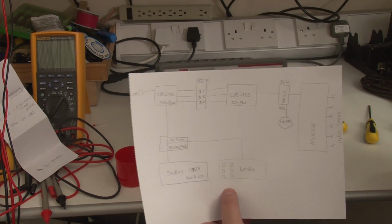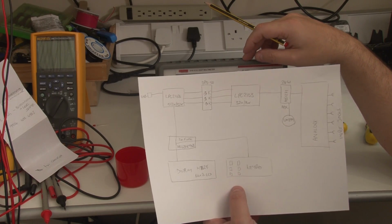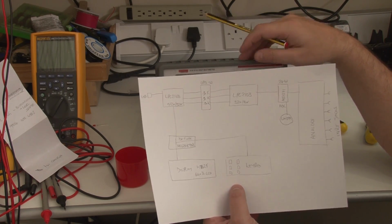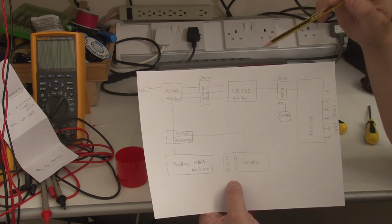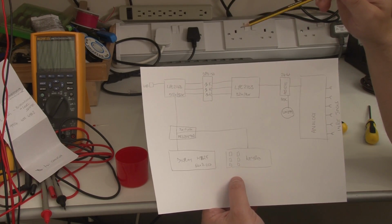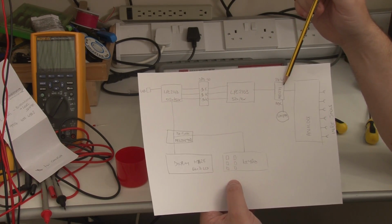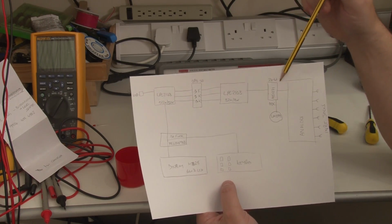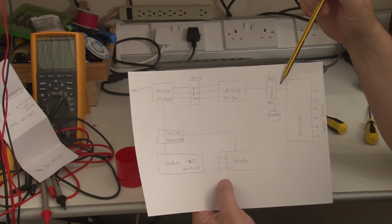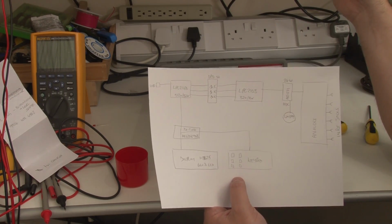One of the things I'm quite surprised by in this, well, I'm not sure I'm surprised or not, but Keithley and HP or Agilent both have patents on various incarnations of multi-slope converters, which tend to be made up of some kind of custom logic and a bunch of analog op-amps and sample and hold circuits and that kind of stuff. And in this meter, they seem to have foregone all of that and just used a straight off-the-shelf part, an ADS1271. I thought, well, that's a bit surprising at first, but I guess when it comes down to it, this is just more cost effective. This part probably costs $3, $4, $5, something like that, and it does the work of all of that stuff. If you look inside an older meter, like the Keithley 2015 I've got up here, there's an awful lot of electronics around doing that conversion.